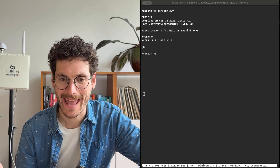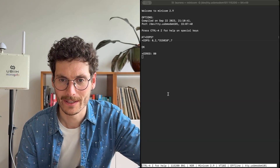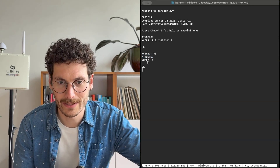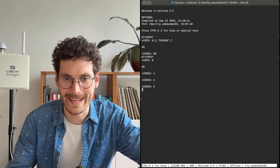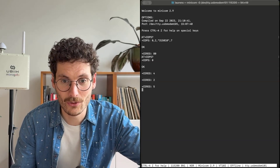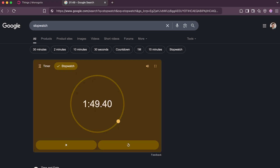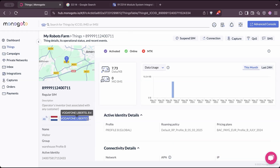There's already something happening. CREG=0 means that the UE is placed in a location with no CAT-NB1 network. Running AT+COPS now shows the device getting disconnected from the network. Then CREG=5 appears, meaning the device is connected to a new network. Stopping the clock — in about two minutes, the device managed to disconnect from network one and reconnect to a new network. Looking at the Monogoto hub after a refresh, it automatically updated the network settings and is now connected to a public network.